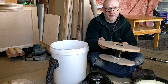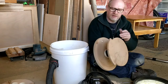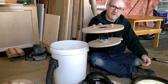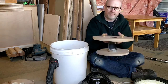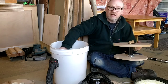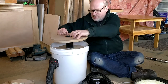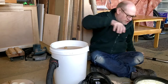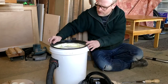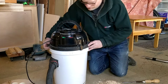So here are the changes I've made. This is now a thicker piece of board and it fits better in the bucket. The fine baffle is connected via a piece of drain pipe and a baked bean can to the top. The air gets sucked from here and gets pulled out here — this is opposite the inlet to the hose, so hopefully you get more of a cyclonic suction. This fits in here — it's a tight fit. The HEPA filter then goes on top, and then I can put Henry on top.